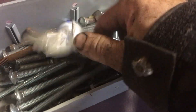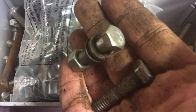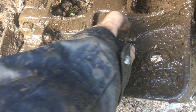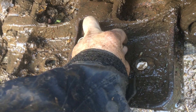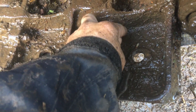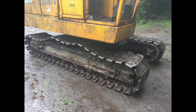Got three options. Not the best quality bolt, but we'll use it for now and reuse the washers. In this case the nut always goes away from the pin — the pin bears on the head of the bolt, and the nut and the excess faces the other way, as you'll see on all the other ones. Tighten that up. You can see the silver bolt down there, and here it is back together.